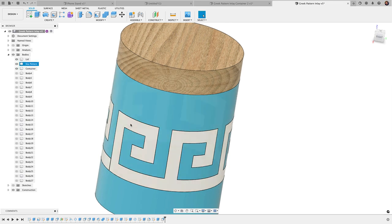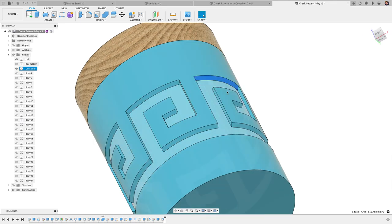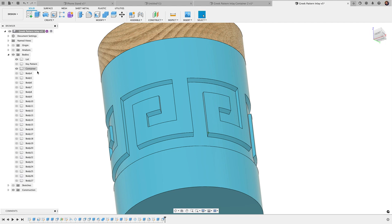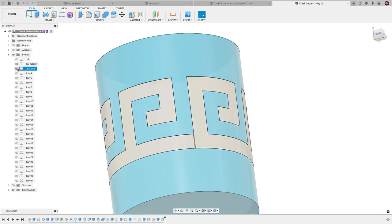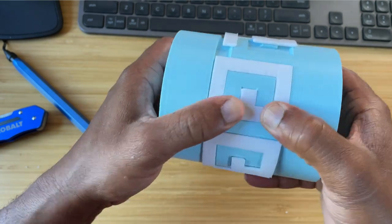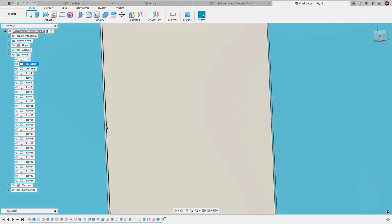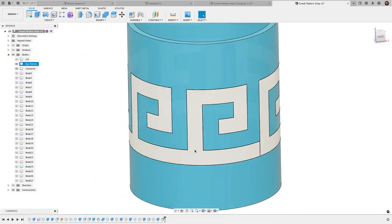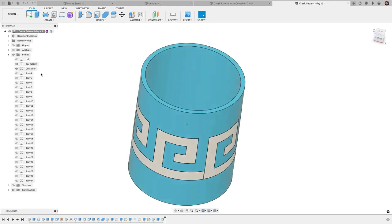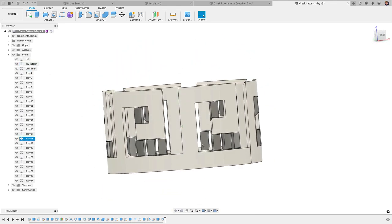Let me take this timeline and bring it to the end. Notice this key pattern is now flush with the container. I'm going to show you how I did that, and you may have also noticed some chamfers here — a really great strategy to apply to your parts when trying to avoid printing supports. We'll also cover the approach to get the Greek key pattern to fit onto the container, since we're talking about two cylinders and how to get it to snap into place. There's a little gap to allow snapping and also a slit so you can stretch it over the container.